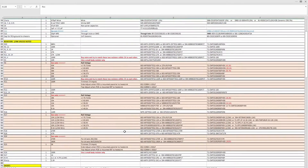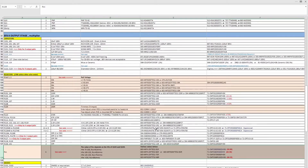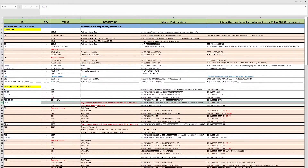Once you've ordered all the parts, let the waiting game begin and start thinking about how you're going to build the amp. In the next video I'm going to discuss how to match some of the transistors and also how to match some of the resistors — specifically R3, R4, R7, and R8 in the long-tail pair near the current mirror, which are critical to amp performance. Buy 10 or 20 extras of those so they can be matched. Thanks for listening — feel free to subscribe and give a thumbs up. See you next time!